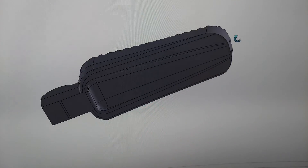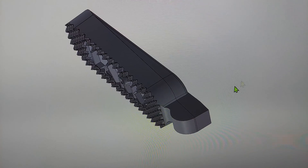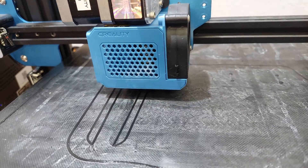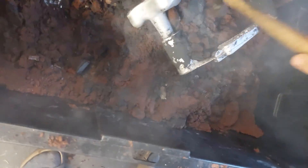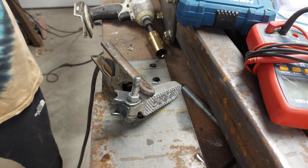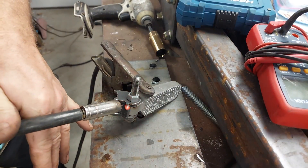While she sleeps I get some time to do CAD — I stole this foot peg design from Dustin, put my own logo on it, and I'm going to claim it as my own. I'm using the CR10 to make some top and bottom molds and I'm going to use my foundry to pour them. I did the most minimal amount of prep — came straight off the printer, scraped it with a wire brush, buried it in sand. This is once again A356 aluminum and look at that — it's beautiful! It needs some cleanup like everything coming out of sand, but I'm super stoked on it.